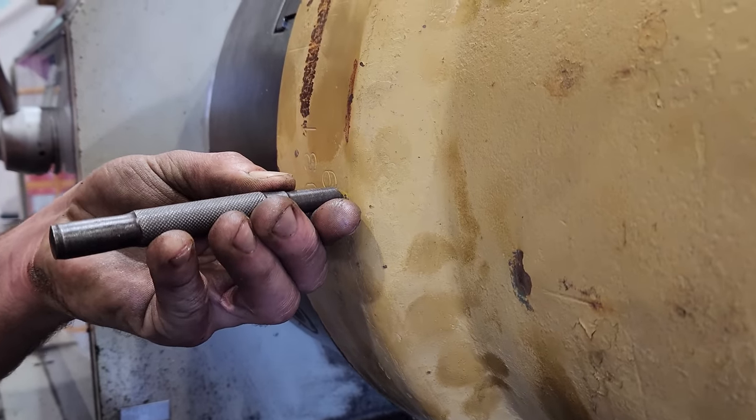Righto guys, so that is the head flange welded onto the barrel. I put about 9 to 10 layers of weld in there. It is still extremely hot and I still have a lot of work to do. I need to turn the OD, hone this to spec and weld on the barrel end. But you'll have to stay tuned for part two. Thanks for watching.